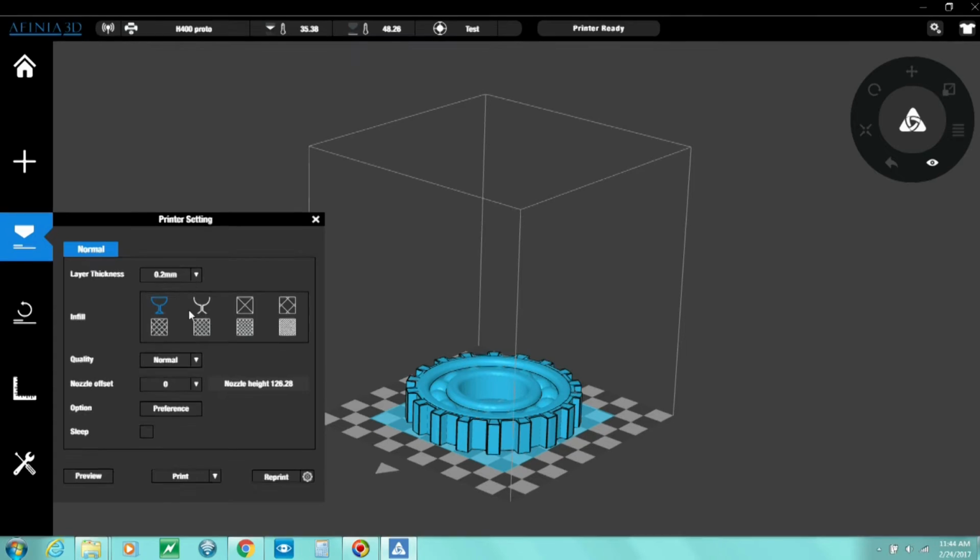This infill is our different options. This is the shell mode. This will print just the outside shell of the object, nothing inside, so it's like an Easter chocolate bunny. This is surface mode. Not something you'll probably use. It just prints the one line of a vertical. And then we have 13% infill, 15%, all the way up to a 99% infill.